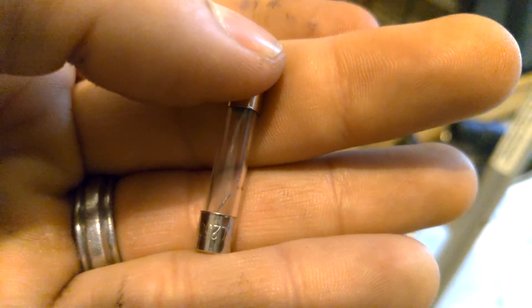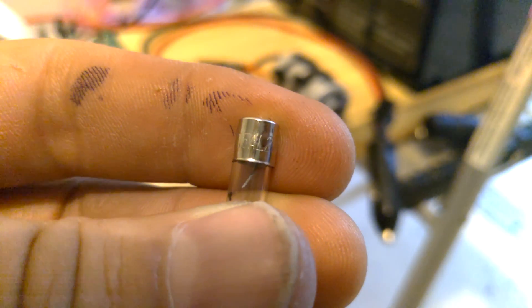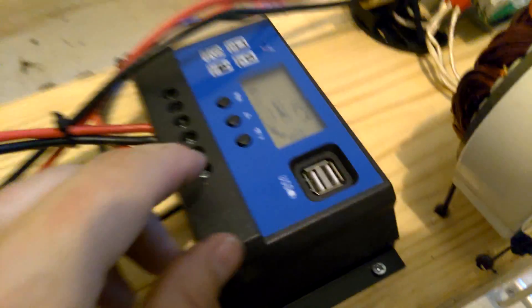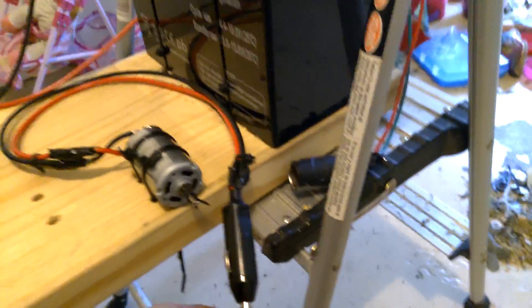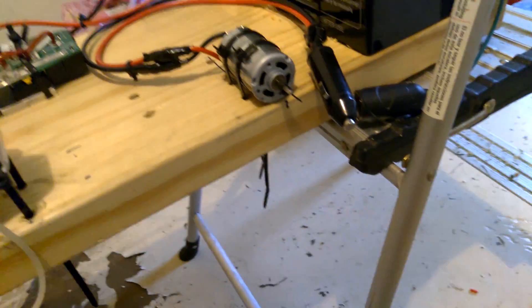So we'll see how it goes. Well, I ended up blowing a fuse. I'm trying to figure out how all this stuff works. It's an F-15AL 250V fuse. I wound up blowing that because I had tried to run the motor off of the outlet here, but every time I would connect it, the little light icon would start to blink and it would stop sending power to the socket. So I decided to just wire it directly to the battery. I wired up this socket, connected it to the battery, and then I'm just plugging it in using this. And I immediately blew the fuse. Thankfully I had two of these — I pulled a fuse out of another one and put that in there. I'm going to connect it real quick so you guys can see how it goes.